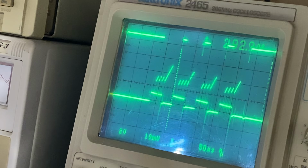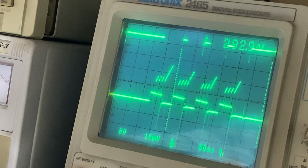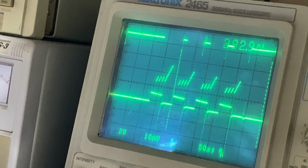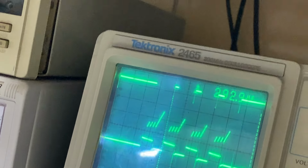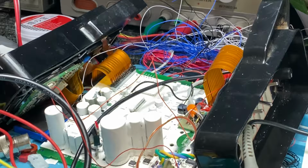I think there's a couple of 3300 caps in this one, you could change them. You could probably squeeze in a couple of 6800 or even 10,000 microfarad capacitors. And possibly with this too, you can change the clock rate of the power supply. I should mention this as well, and I'll tell you where you do that. I'll have to hold this to do this.